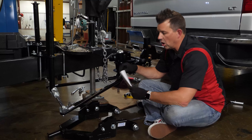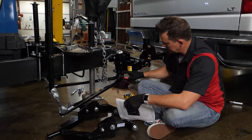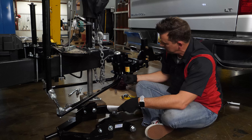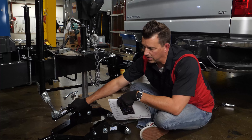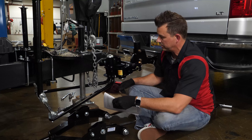We are back — we are to the yoke, so it's yoke time. Make sure that you've got your bushings and your bolt for the bushings right here; it's a 3/8. Make sure that bolt is tight, and make sure you've got your spring bar link tightened as well. Just get that done so you don't have to worry about it later on. Those are good to go.